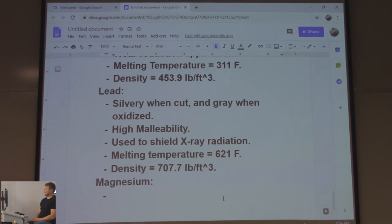There's a part on a car that we've done a number of times. I want to say something off the transmission that is usually magnesium. So whenever I get a car part, I'm very careful. I'll weld a little spot on it first and make sure it doesn't go ting-ting, because if you put a giant weld on and it's just shot, you're done. Now, we can weld magnesium with magnesium wires, but if you don't identify it first as magnesium, you're going to destroy it.